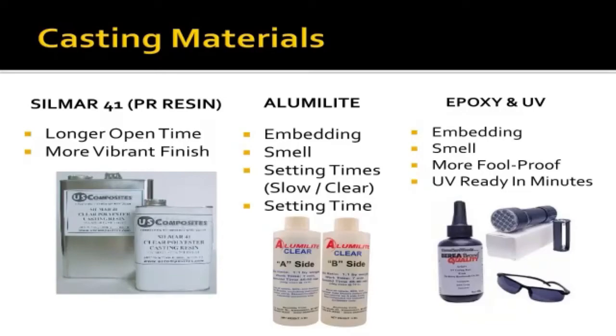It makes a beautiful river table. If you're looking at river tables, or you're doing any kind of flat work and you're only going to sand off a 16th of an inch, epoxy is the way to go if you can't have a pressure pot. But if you've got a pressure pot and you can pressurize it, I'm going to do one of those two different techniques.